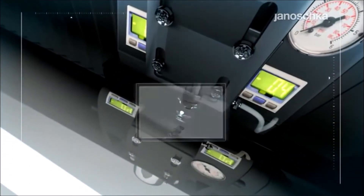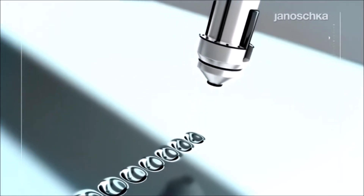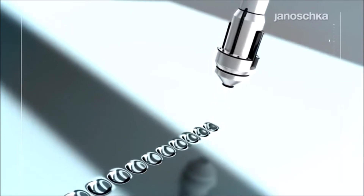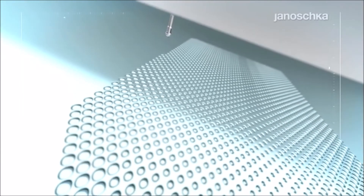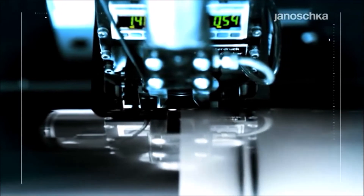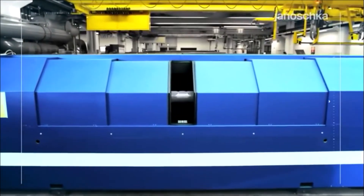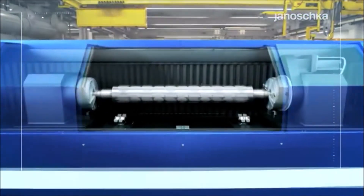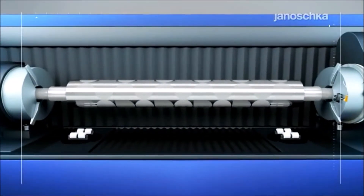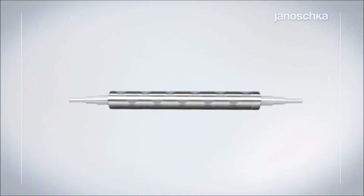The direct laser system uses a laser beam to create the image onto the zinc surface without actually touching the cylinder. Variety in depth and shape of the cells offers the perfect range of reproduction options for all kinds of motifs and their specific details. The excellent quality of the direct laser is evident by the contour sharpness, the high resolution image reproduction, and perfect half tones. Line and text elements are characterized by optimal acuity and perfect solid tones.